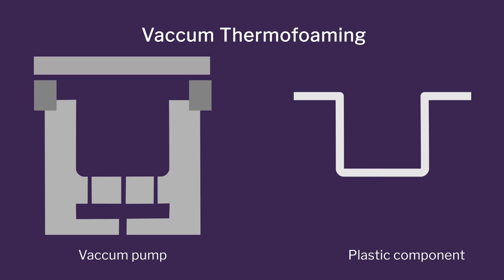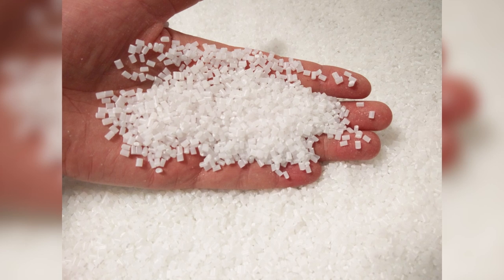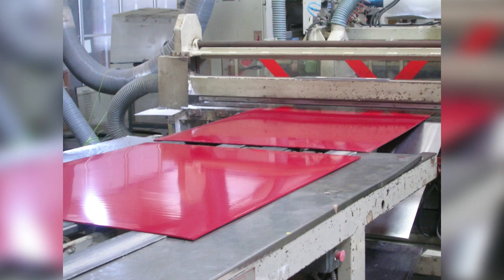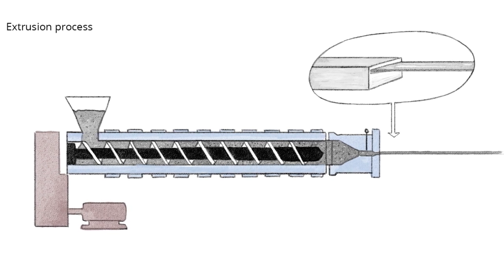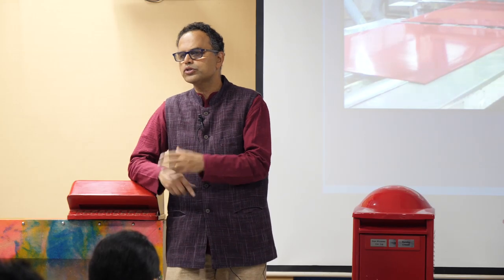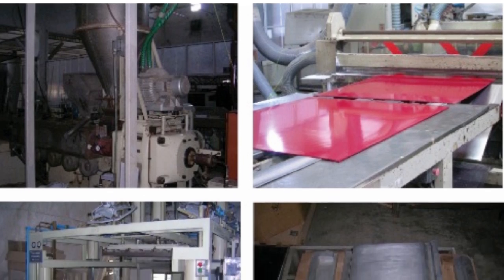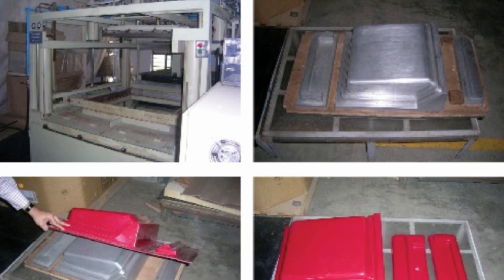In the cavity also you suck it — it adheres to the cavity and you get this tray shape. We used the same technique to make the next level. In this process we had to go and get the raw material also. Luckily GE Plastics collaborated, so we got these granules. The plastic is made in the form of granules and we made sheet out of these granules by extrusion. You heat the granules and extrude them out of a thin slit and you get these slabs of plastic. We extruded the sheet ourselves because nobody has this red color — we had to get the granules and extrude the sheet on our own, and then we made these dies: the three-part die.